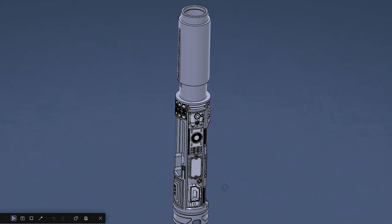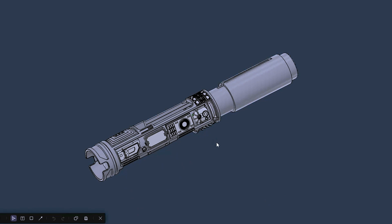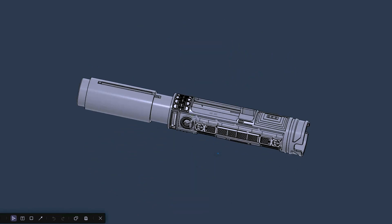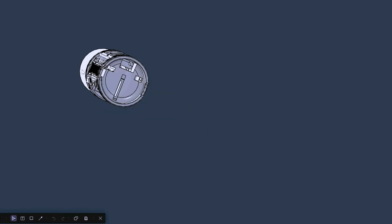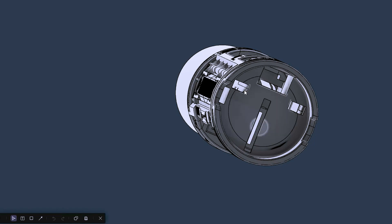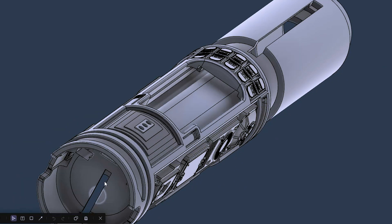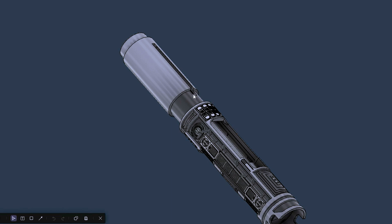Here is the chassis I designed for this hilt. In typical Tierphon Orbital fashion, there is an inordinate amount of greeblies on each side. I've also put a vent that cleverly hides a 20-20 NeoPixel strip that goes down this channel. These two channels are my wire passages — they come up to the board here. There's a 28-millimeter speaker at the bottom, and I've added another 20-20 NeoPixel strip in this channel.